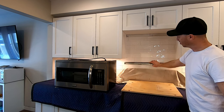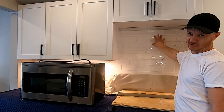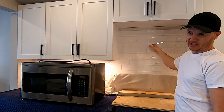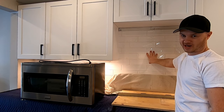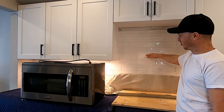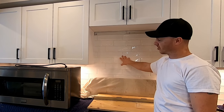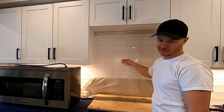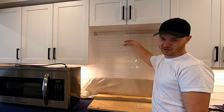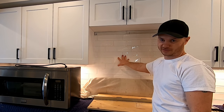A bar goes in the back. I like to tile the whole back area, otherwise you've got to try and build it out. The other problem is when this microwave dies, I don't want to redo the tile — so it might be just a little bit higher or a little bit lower and you don't have to worry about shimming. It's not fun drilling through tile but usually backsplash tile is pretty soft, and I have a few extras so if I put a regular hood in, it's not a big deal to replace a couple tiles with holes.